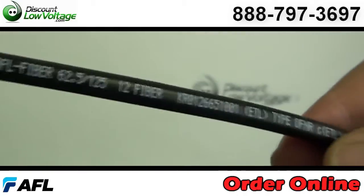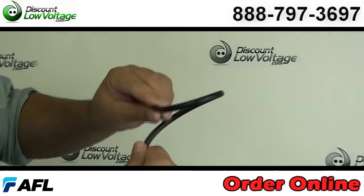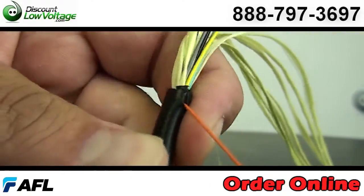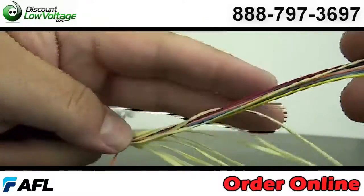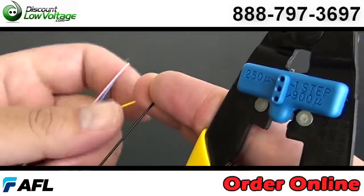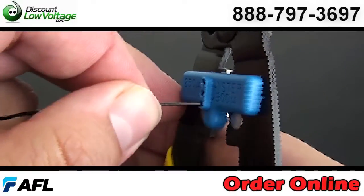Now this fiber is most commonly used for building-to-building applications. The cables are water blocked and meet water penetration requirements of GR20-COR code. The outer jacket is moisture resistant, fungus resistant, and UV resistant for outdoor use. This also has a riser rating, so this cable can be used in all environments: riser, general inside plant, and outside plant. And one of the nice things about it is it's MSHA approved for mining applications.